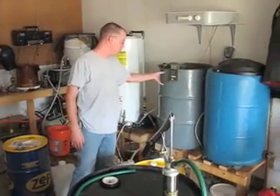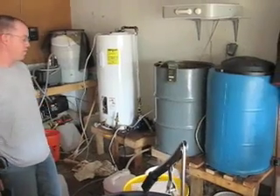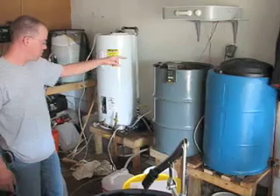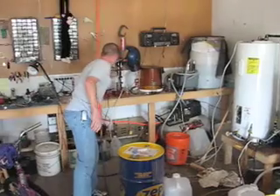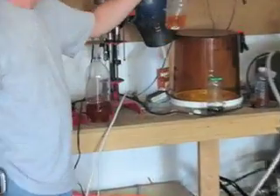Then it pumps into this tank, which has a heating element in it also. I only run it in there for about three hours. It pumps the biodiesel around to heat it up to about 140 degrees, which clears it — it goes from a cloudier state to a see-through state where you can look right through it. And that's when it's done. Then you can pour it into the barrel here or pour it straight into your car.